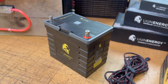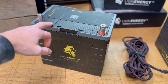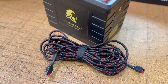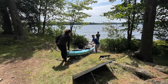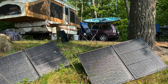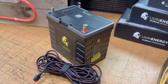We've used the solar panels, a couple of batteries, and the solar charge controller when we go camping — we love to camp in the UP in a pop-up. I take a couple of batteries wired together in parallel for 210 amp hours, and run the 25-foot Lion extension cable out to the panels. Even among the trees, I'm able to chase the sun around. This last summer I discharged the batteries down to maybe 50% after a rainy day or two, but on the next sunny day the batteries were back to 100% and we never saw less than 80% for the rest of the trip.